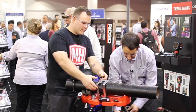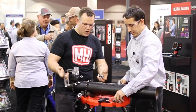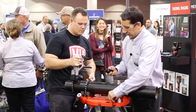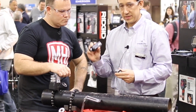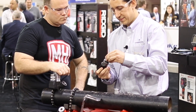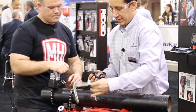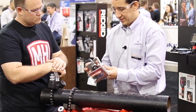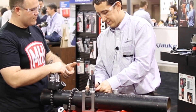You've got a hole drilled over here already with the guide on here. We can take this guide off real quick and you're ready to go. So you've got your expander here and the first thing we'll do is attach it to the fitting. This expander piece — the fitting loads on the end and gets threaded on. This piece is going to go one end into the pipe and the other end will attach to the press tool. There's a guide here that helps keep the fitting nice and square on the pipe, so you have a nice square connection. And you're just inserting that down into the hole you've already drilled.